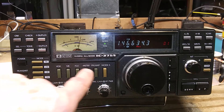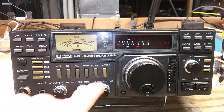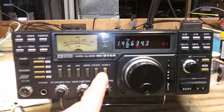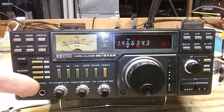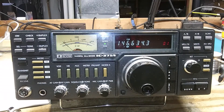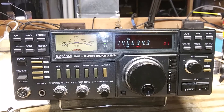This is the preamp — you can see the needle just went up. This one has the built-in preamp. And this is the mode selector switch. So if you're in CW, but in memory you have CW, FM, and sideband memories, by pushing this in and going to memory mode, when you hit scan it will only scan CW, because it's on CW right now.